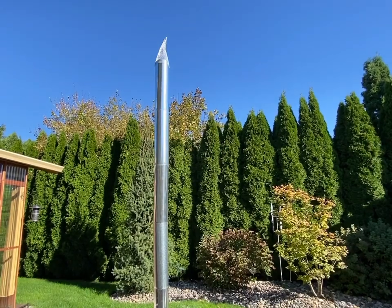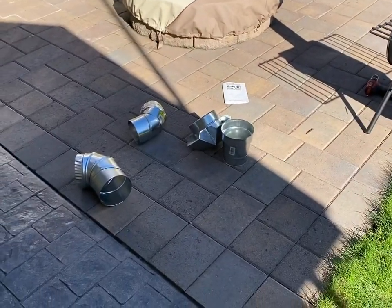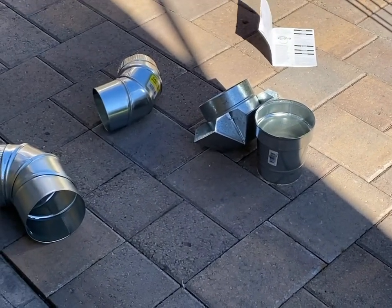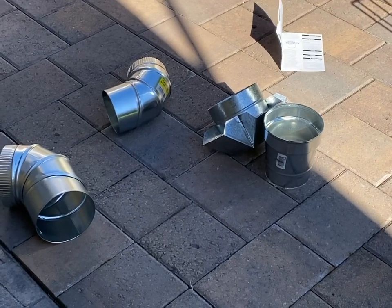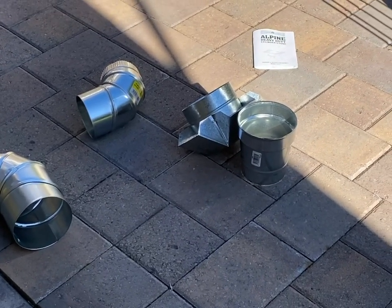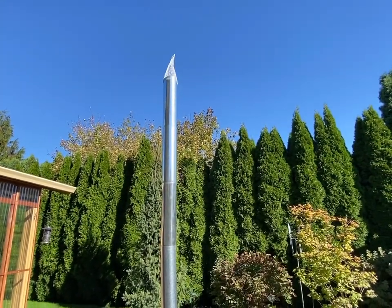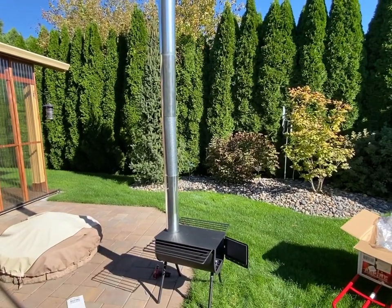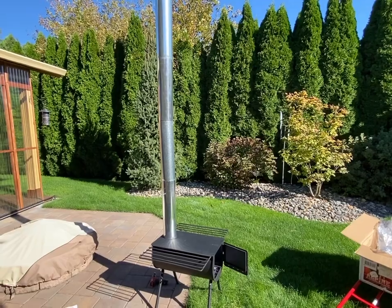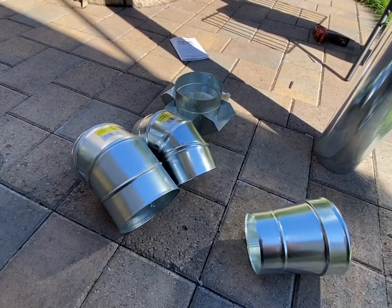You can imagine if the wind blows, that tall stack is not going to last long. I've got a few other options in mind - whether I'm going to put it in a shed or a situation where there's no power and I'm running it through an outside wall. As far as the pipe joints go, that configuration is not going to work as-is - you'd need flue tape around the joints and probably some clamps, plus some sort of brace to solidify the structure.